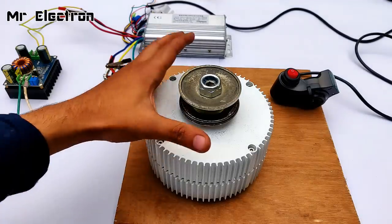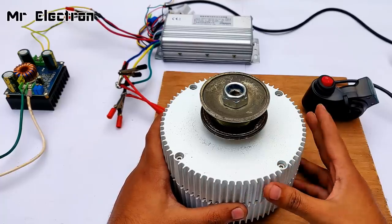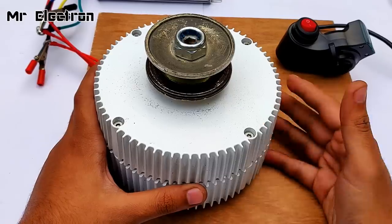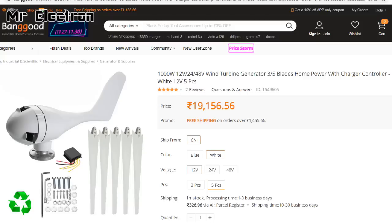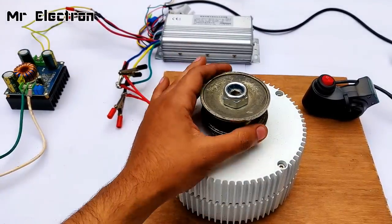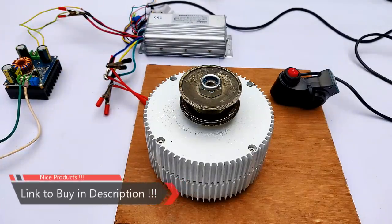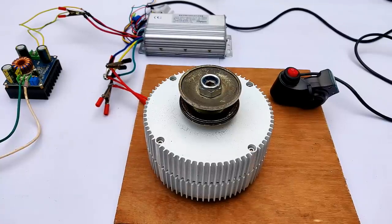The best thing about using a wind turbine generator as an electric motor for scooties and electric motorcycles is that the large number of poles increases overall torque, though it reduces speed — but that is exactly what a gearbox does with added losses. Without any losses, you can get very high torque. The RPM of this wind turbine is only 400, and its power rating is also 400 watts — 400 RPM with extreme torque, no gearbox, and no frictional losses except for the shaft bearings. All these products are from Banggood, with links and Black Friday sale coupons in the description. That's all for this video — see you in the next one. Thank you.